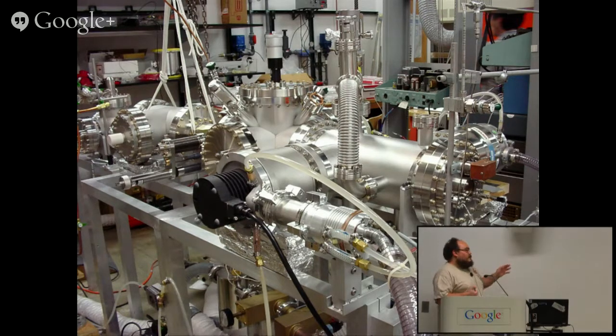So yeah, masers, shiny. Nice on a short term, hours, days maybe, but longer term cesiums are still more accurate. Commercial maser standards are maybe about the size of a beer fridge. They're not that big. The lab standards, like the lab atomic clocks, the cesium fountain designs you sometimes see referenced, they're big and crazy because they can be. They're in a lab, they need to be isolated for vibration and such, and they're not made to be mass-produced, even on the scales of a couple of hundred. They're made to be made maybe two or three.